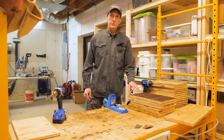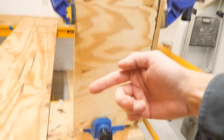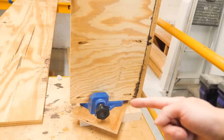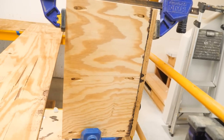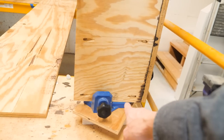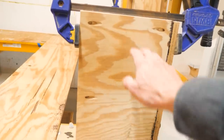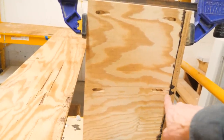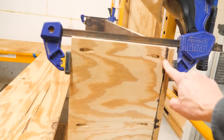I just have to do that seven more times. The back piece is clamped to the side piece using the 90-degree corner clamp at the bottom, then I adjust the top. I screw it from the bottom, then adjust the clamp because there's a little bit of a bow in the piece to make it perfect, then move up and clamp and screw that one in.